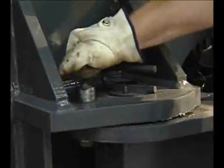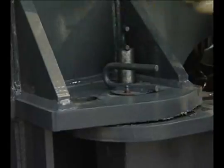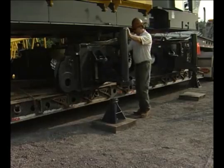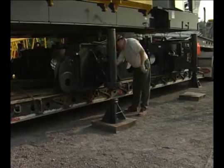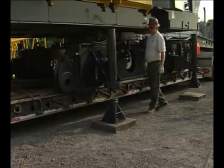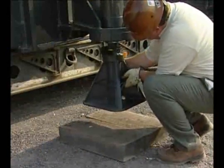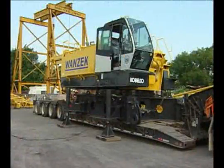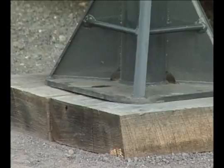To operate, first remove the swing arm locking pins on each of the translifter swing arms and place them into the empty hole next to them. Swing the translifter arms out to the working position and the locking pins will fall into place. Make sure all 4 locking pins are fully inserted and spring pins are installed on the bottom side of the lock pins. Install the floats on the bottom of each translifter and secure with locking pins. Unless working on concrete or a very hard surface, use good quality matting or steel plates under each float.